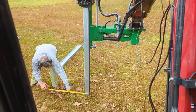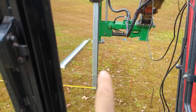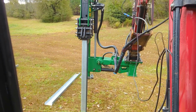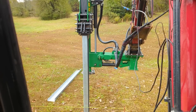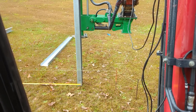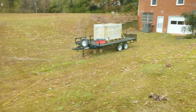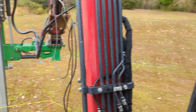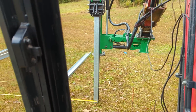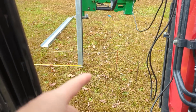We're pounding posts — three posts to put in. We do a 160-inch layout and then a 202 and keep going. This is 12 panels in a row, 24 panels total. Hold your ears — everybody's got ear protection. I'm trying some noise-canceling headphones today and they're working really well. If we can get these posts in, get this built, get the solar panels on, then I can take that trailer home. We're doing the trailer relay these days but it's working really well. Just got about six inches left to go.